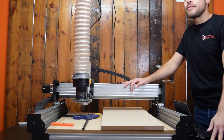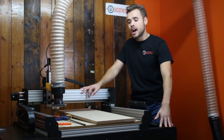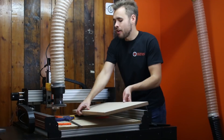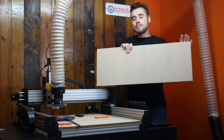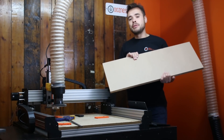The working area on the machine we've got here is 550 by 520mm, so we have a 520mm Y axis — that's the maximum we can cut. The sheet material I've got here is an 18mm piece of MDF, and this is 300mm wide by 800mm long. So normally we would not be able to cut the full length of this piece of material.